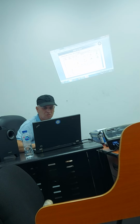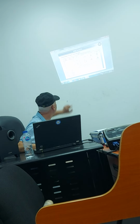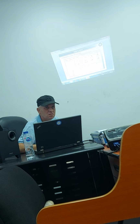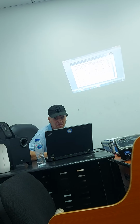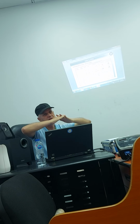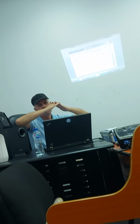Blue is 8 ton. Brown is 6 ton. Orange is 10 ton. Vertical, one line, mode factor equals 1. Choker, mode factor 0.8. Basket, mode factor 2, double. Basket hitch, like this, 1.4, or if a big angle, only 1. Two leg, like this, 1.4.